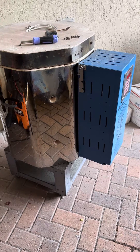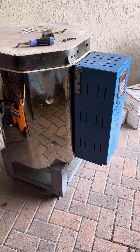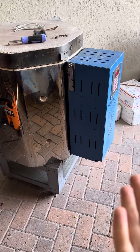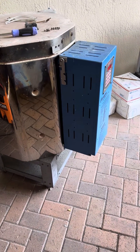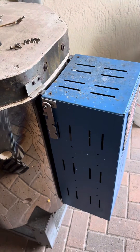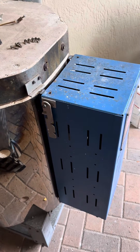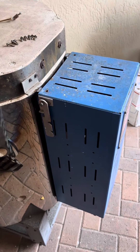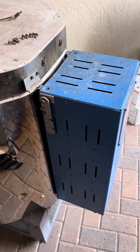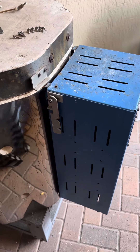Good morning! Today I want to give you a little tour of what's inside your controller box of your kiln. This is a Paragon kiln with a Sentry controller. First and foremost, your kiln is going to be off when you do any type of electrical work — and I mean no power to it. You have to either unplug it from the outlet or shut off your breaker if it's hardwired, but no power to the kiln when you're working on electrical parts.